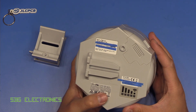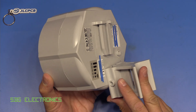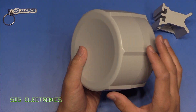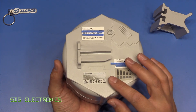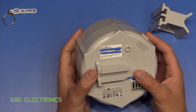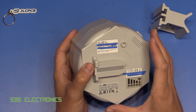What we've got here is the Mikrotik SXT LTE 6 kit. It's an external device — you can mount this on a mast; it clips onto the back and then you use a jubilee or hose-type clip that goes around and clamps it to your mast outside. It has a directional antenna built in, and it also has hardware that allows you to run RouterOS, which is Mikrotik's firmware. So this can effectively work as a fully functional router.